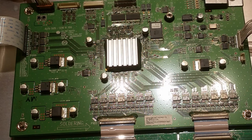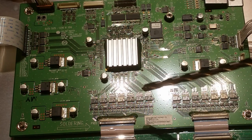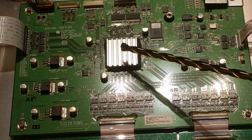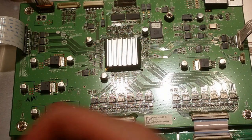Here we can see a close-up — you can see the chips here. We got a bunch of chips on all the outputs, and these are octal bus buffers, three-state output, non-inverted. So they buffer up the signal from the main processor so you can drive these different stages.